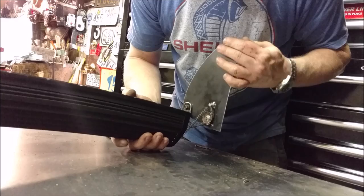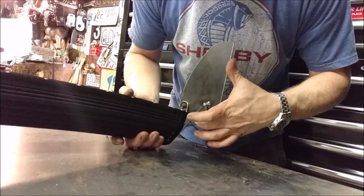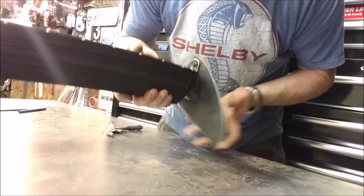So originally I just had one spring installed, but that wasn't strong enough, so I installed two. One in the back of the light for leverage and one more on the mount. But the springs were interfering with each other and binding, so one, I had to route around this little bolt with a washer on it to retain it. And now they stay out of each other's way, whether the light's moving forward or back.